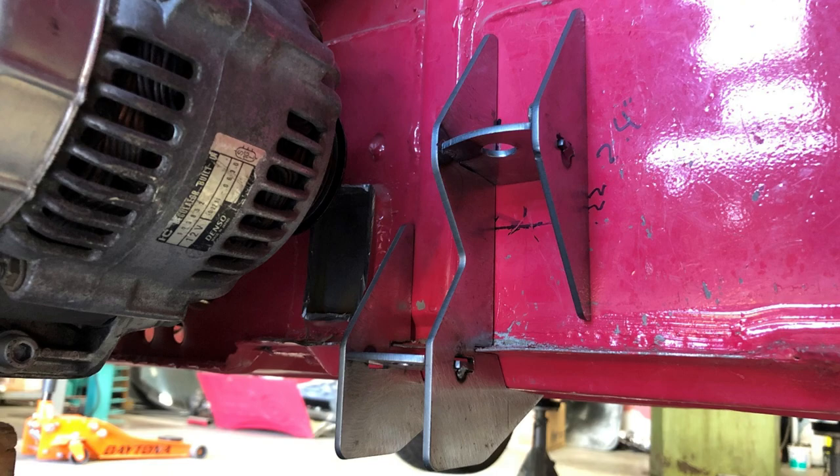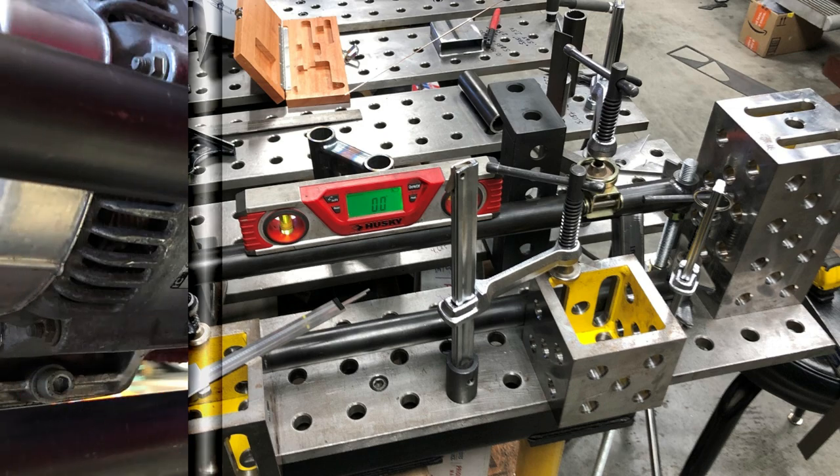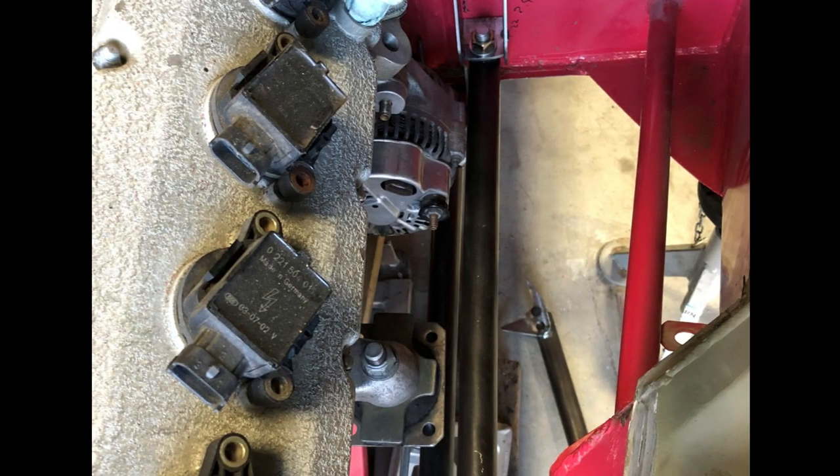The redesign uses horizontal mounting points, which necessitated a redesign of the tab set as well. But it meant I could much more easily slip the cradle and those four front firewall mounting points up into position, versus trying to slide them in between two tabs — a much better design, if a couple steps backwards. With that design change finalized, it was back to the fixturing table to build the engine cradle. Here's the fixturing assembly I came up with that helped me locate everything and hold it in position while it was all being tacked together.